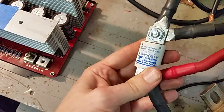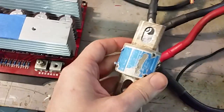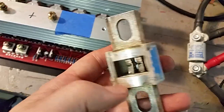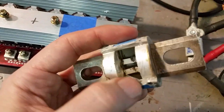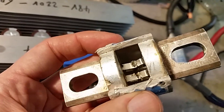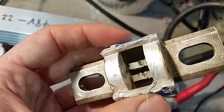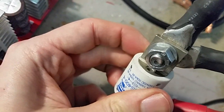Yesterday I got my replacement fuse in after blowing the other fuse on another mishap. I opened this guy up out of curiosity — that's what it looks like on the inside. Of course it's filled with sand. What they do is solder in these little ribbon bar things with a melting point in there, and then the arc is extinguished by the sand — it's kind of like a silica white powder. And the same thing is inside the other one too. There are plugs on both of these; that's probably how they fill the sand in.